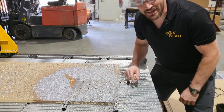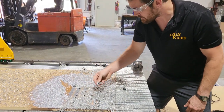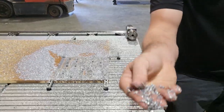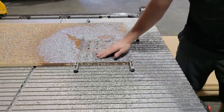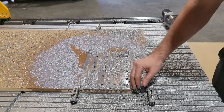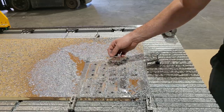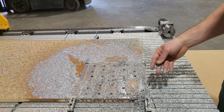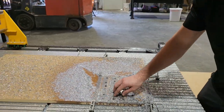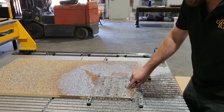Alright guys, I told you we were going to make a mess — and boom, here's the mess. If I had left the brushes on it would have helped some, but you can see we have this slurry. We made some really good chips here — we're probably going to turn down the coolant just a little bit, but those are quality chips. Now, I had forgotten about one more op: we have an operation here that's going to come in and do rest machining on this little internal radius. I used a three-eighths end mill to cut it, which was really too big — you could have used the one-eighth for the entire thing and the job would have been done sooner. But I wanted to put things through their paces, so we're switching over to that one-eighth tool now to do the rest machining and get that small internal radius.